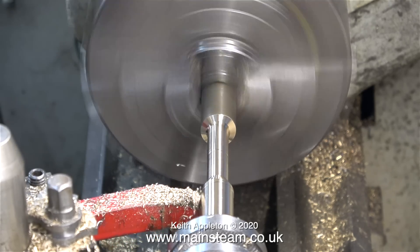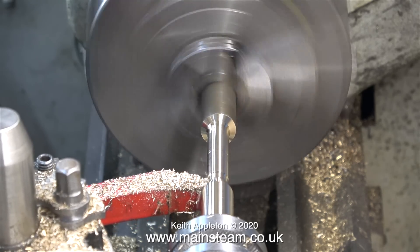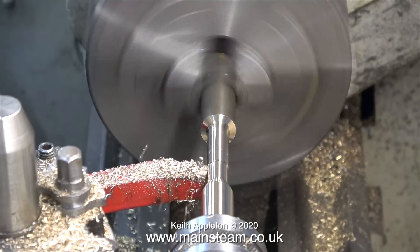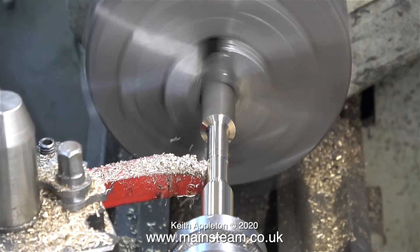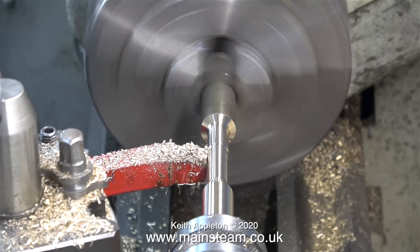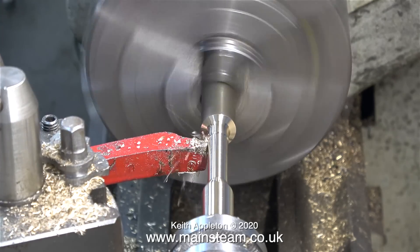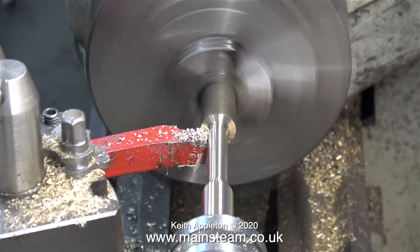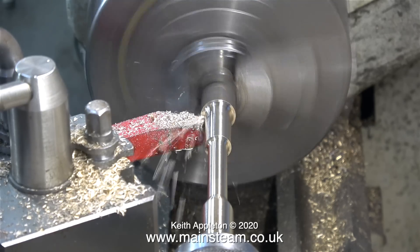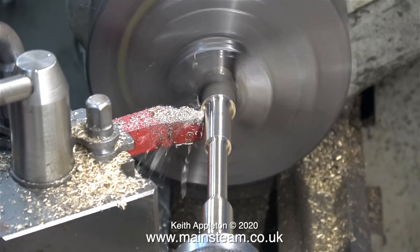What I'm doing at the moment is taking a fine cut from the bottom part of the pump handle, and once the cutting tool gets to the right place I wind it in quickly, now turning the thinner centre part of the handle. By doing it this way you create a continuous curve on the lower part of the handle, but I don't want that continuous curve to continue on the upper part. I will leave the end part at the same angle as the cutting tool.